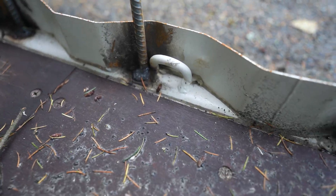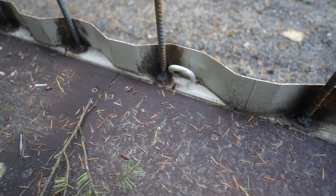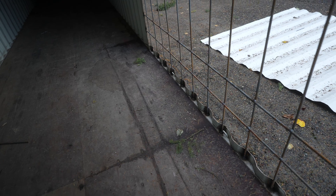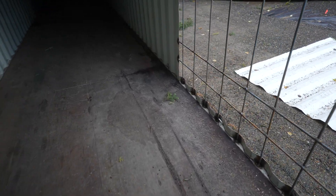The rebar is sitting on the floor — you can see it's welded onto the floor and also resting at the top. It's sitting straight up, actually helping to keep the container stable. Once we add the horizontal bars, that'll stabilize the vertical rebar and make everything really stiff — not moving left and right, not in and out. It also welds right onto the outside, and we're going to do the same on this side, so it's getting pretty sturdy and stable, providing the protection we're looking for.